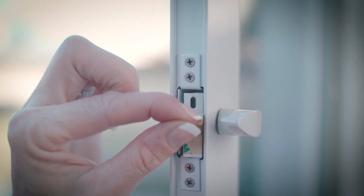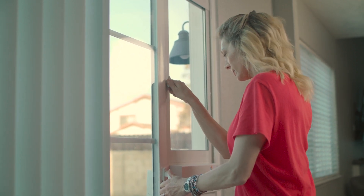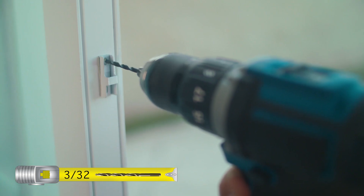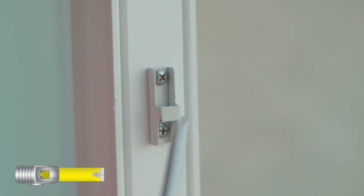Remove the tape backing. Slide your patio door closed. Turn the lock handle clockwise, releasing the lock hasp, and open your sliding glass door. The lock hasp should now be affixed to your sliding glass door. Drill two holes within the slots of the lock hasp and screw the lock hasp to the sliding glass door.